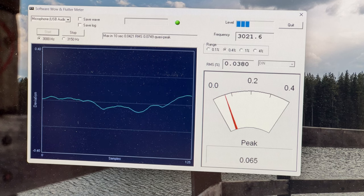Okay, so the power supply. I just did one-to-one replacements on all of these. I'm not going crazy and experimenting with this. This deck is too old. I don't want to play with it very much. So yeah, Panasonic FR, anywhere I could find a use for one. I think there are like three 470 microfarad caps. All of those are FR. And I think this one's 1,000 microfarad. That one's FR. And of course, the two main filter caps are FR.